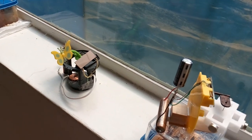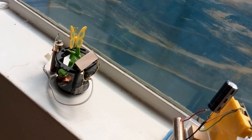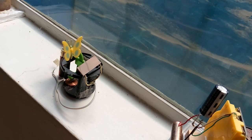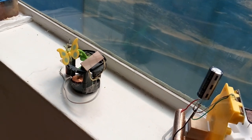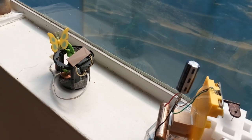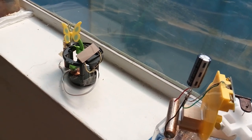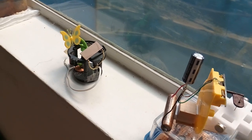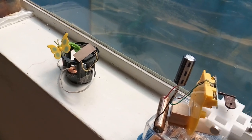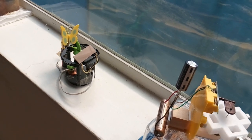So I took a solar waver apart and simply added a AAA battery with a dropping resistor — I think that's 30,000 ohms to drop it down. What happened was it would run at about 15 microamps during the day and go up to 40 microamps at night. I went back and looked at the video — that's been running for four years, non-stop around the clock.